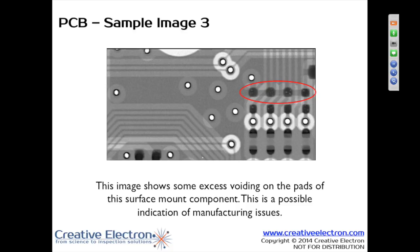If you look at the third solder joint over, you have a lot of microvoiding. You may actually have a failure on that solder joint more so than the one next to it that has three large solder voids, based on the fact that it's all micro — it's very porous inside. It's not a solid solder joint. I would say that would be a worse solder joint than the one with three voids just based on the amount of small microvoiding, because it creates a lot of mechanical stresses and there's really no attachment.